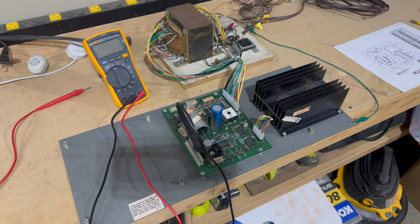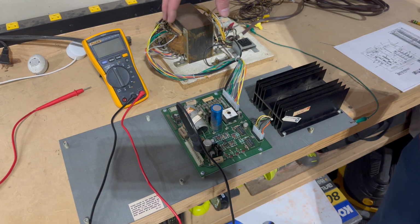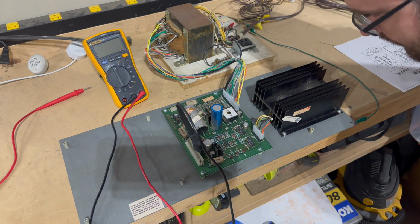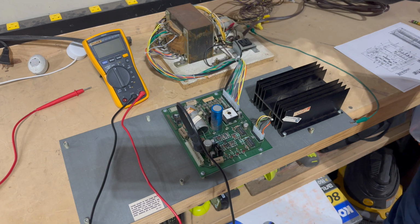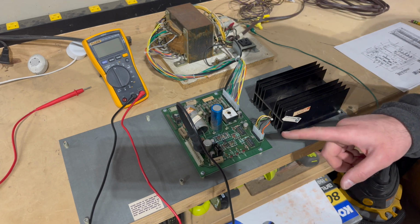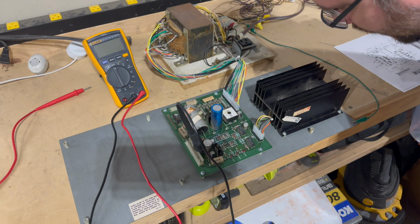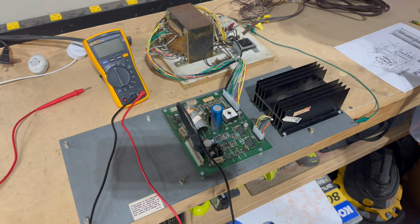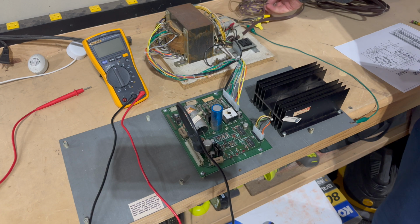So that being said, I think we're ready to test this, right? So I've got it all plugged in. Charles Klein's new transformer wiring going into connector 4J1 with the new header pins there. I've got the transistor heatsink mounted with a new connector housing to the new header pins for 4J4. We're mounted on the board, ground to the transformer.